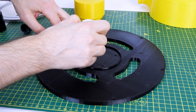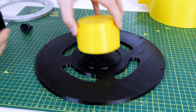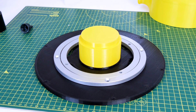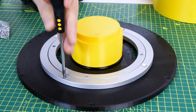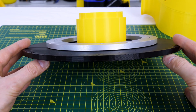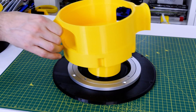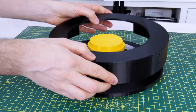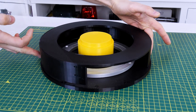I 3D printed a big base for the whole machine and that has another lump attached which is glued on, and that will bring the screw up to the correct height so that it matches the height of the catcher now sat on the Lazy Susan and its base. The Lazy Susan is screwed down with four countersunk self-tapping screws and I've put little washers under each one so that the inside can turn freely without any friction on the base. There's also a base to be fitted and I've left a hole in there so that we can fit the drive system in later.